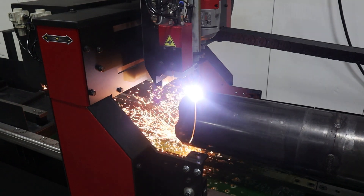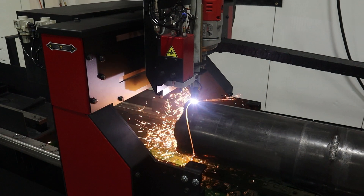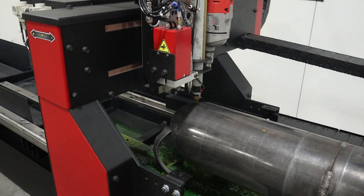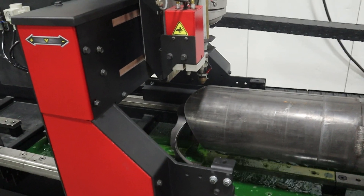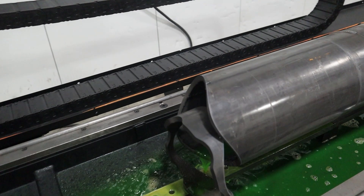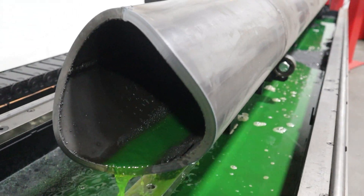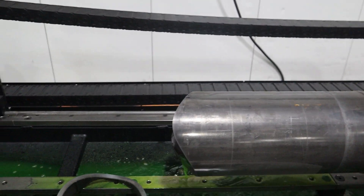One thing I didn't mention earlier: the control panel gives us the setting for the amperage of the plasma — it was 65 amps — and I went ahead and adjusted that. There we go, that's our cut. Let's get on down here, you can see the quality of the cut. Looks really, really nice. Anyway, that is how we cut 8-inch pipe.